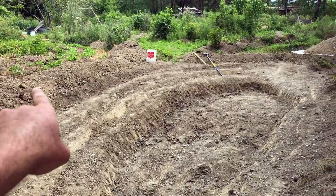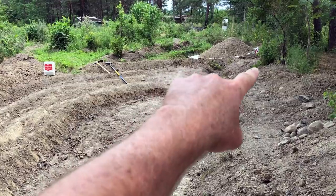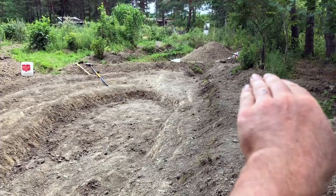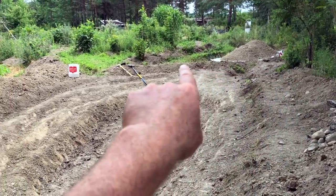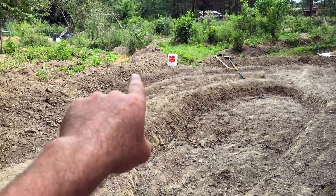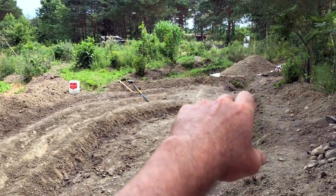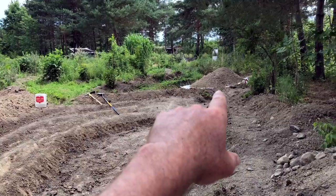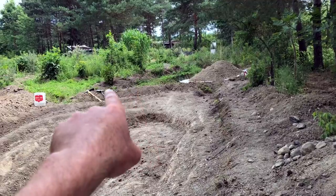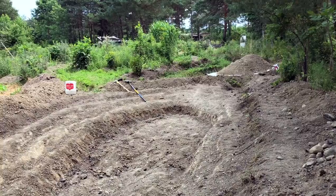As we go through, we're laying up this berm of soil all the way around. What that does is reserve the option that if I commit to a liner, I could bring the liner up to here and pin it down all the way across — I'd just have to find level in advance. I also took a tarp, set it off to the side, and put some really crumbly material on it, so if we get a liner we can cover it or use it to find level or build up the berms. Either way, we've got material in reserve that's ready to go.